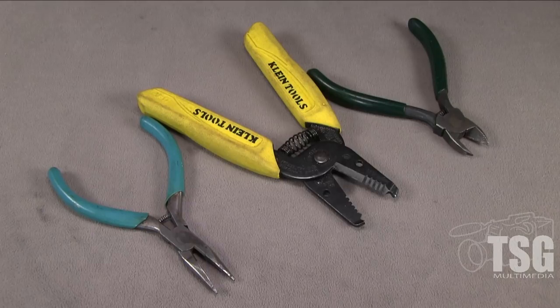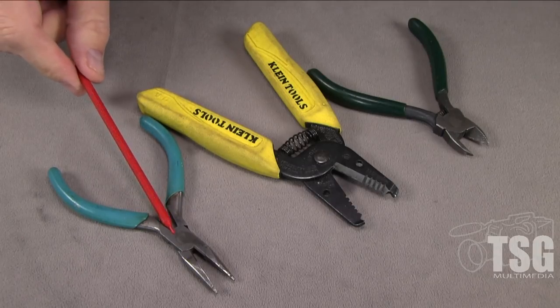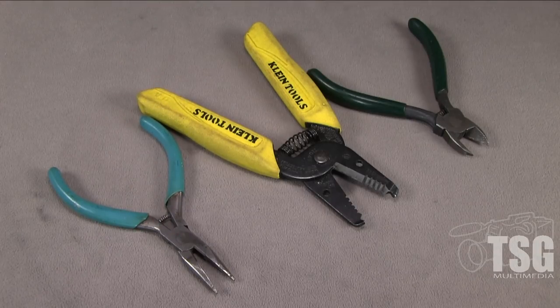That's really small. Usually the ones you find in a hardware store do bigger gauge wire, which is also sometimes useful on a layout for running DCC bus wires or something. You want to use larger gauge wire for that. But I think the ones in the hardware store are geared toward in-house electrical work. That's usually bigger than 22 gauge. The same needle nose pliers that you can use for track work and other things also really come in handy for electrical work too. We saw those last episode, didn't we? We did. I thought they looked familiar.